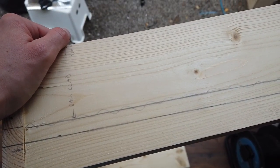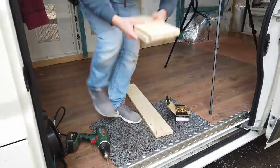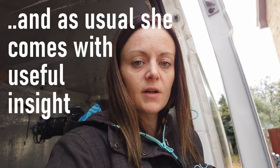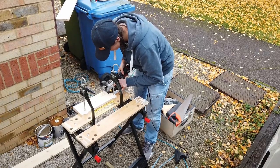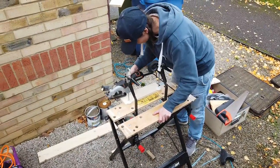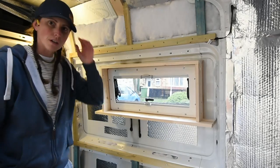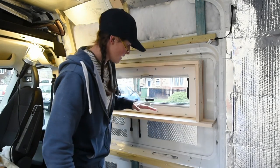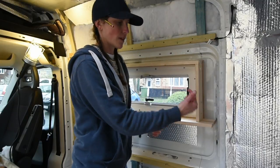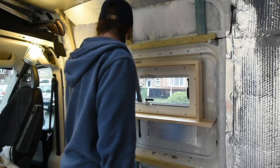I'm going to cut this, take it apart, cut both pieces, screw it back together and try and fit it again. Just waiting for Louise to clamp everything together and get it all ready so she can cut it. To get this piece to sit relatively straight you'll then need to get a square against the piece you've cut at an angle and run that back across to bring it up, otherwise your whole window will sit slightly out. I didn't film that bit.